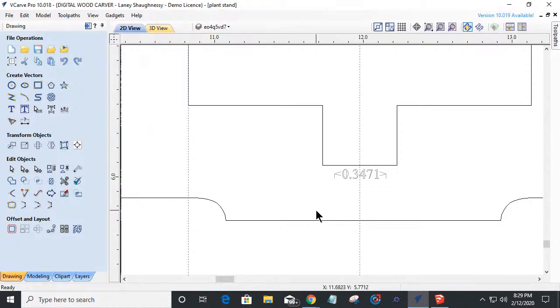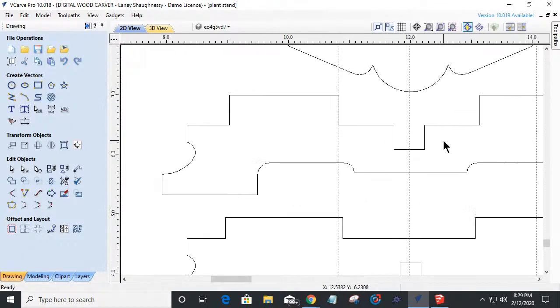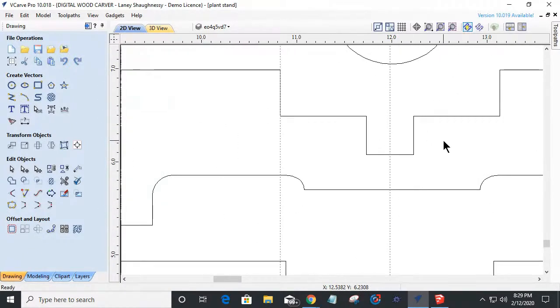Now, Lainey, are you set? These are the questions you should be asking. Lainey, are you actually set? When you scaled this up, you didn't measure how thick this part is right here so that when both pieces go together, they're flush at the top. Are you sure that you're set? Did you do that math? Because I didn't see you measure that piece right here to make sure that that depth is the right depth. And you'd be correct asking me that question.